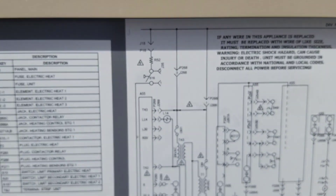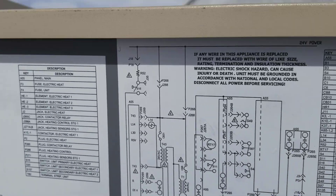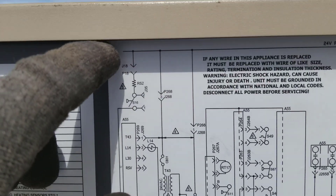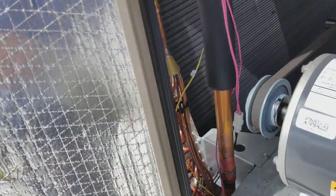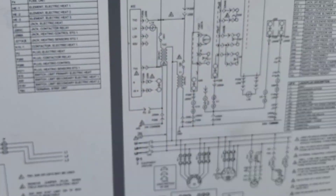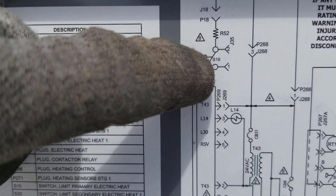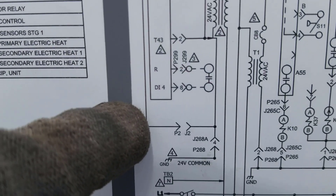They call it a resistor, but I believe it's a heating element — kind of like a miniature crankcase heater. It's mounted down there, and you've got your 24-volt rail up here feeding the top of that resistor, which is the pink wire. It even says on here: R52 J18 slash 24-volt AC. They actually describe on the wires what all this stuff is and where it goes. It's very descriptive. So that J18 goes to J18, it's 24-volt power feeding that, and then the common side has a switch, S16 in series with it, and S16 goes down to common.